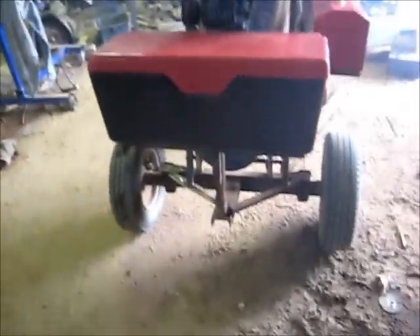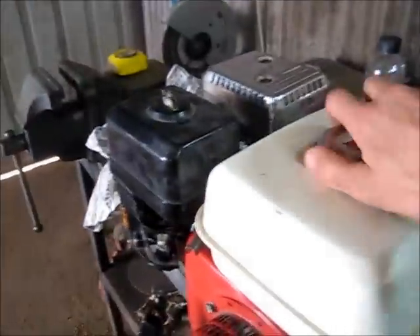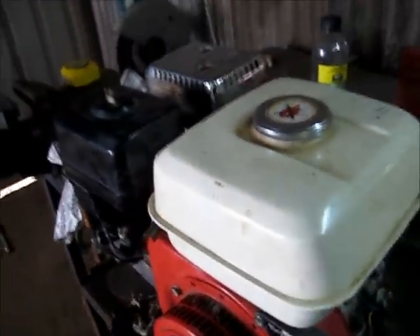The oil's out and it's running quite nicely now. A lot of carbon came out of there. I've got to wash the messy oil off this air compressor, give the engine a bit of a degrease and wash down, then put it all back together — and yeah, she's fixed. She's got fresh oil, fresh fuel, cleaned it all out, washed the cylinder with a bit of turps to get the excess carbon out. She's running beauty. Thanks for watching.